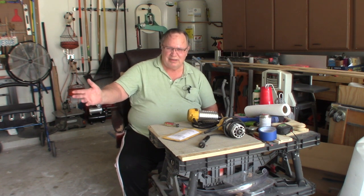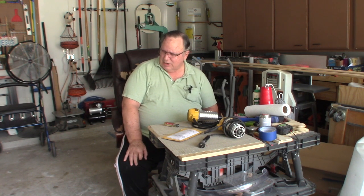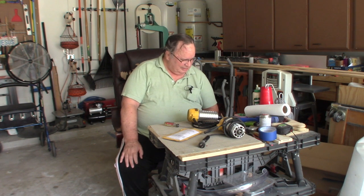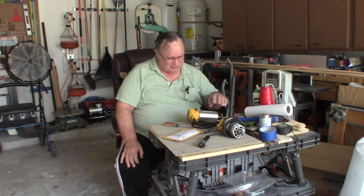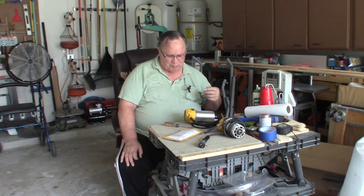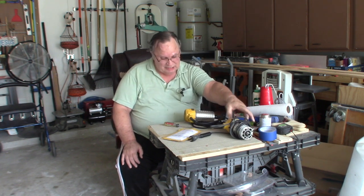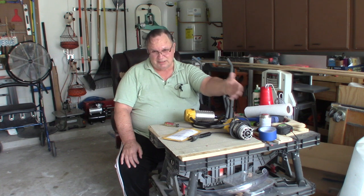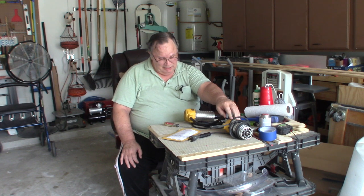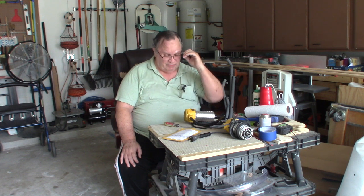I bought my plywood yesterday and was going to start marking it out today and cutting it out, and was doing a carving last night, and I noticed my router was growling at me, making a lot of noise, telling me that my brushes are probably shot in it. This router here has been sitting out in the garage for months and months because the brushes on it are worn out, and I just never got around to replacing them yet. Otherwise known as a procrastinator in chief here.